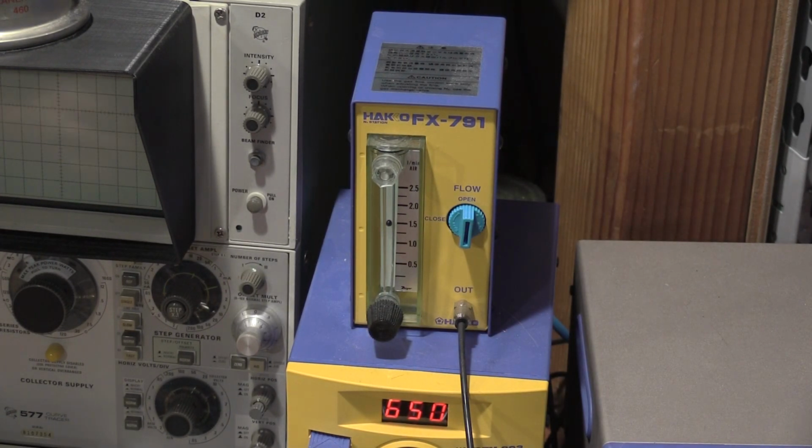So I do not need it hooked up to gas bottles. The other thing to be cautious of if you're going to set something like this up in an enclosed space is you can get nitrogen asphyxiation by just dumping gas bottles into the environment. It can displace the oxygen, and you can pass out and suffocate. The oxygen that is in the shop air is being dumped into the room, so my room mix of gases isn't changing. However, that would not be the case if I had this hooked up to bottles. It was one of the other reasons I set the system up this way, regardless of the cost.